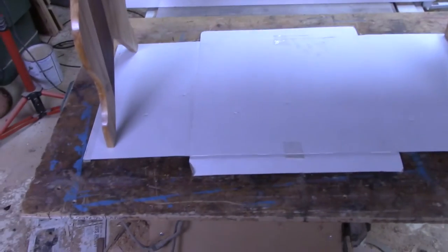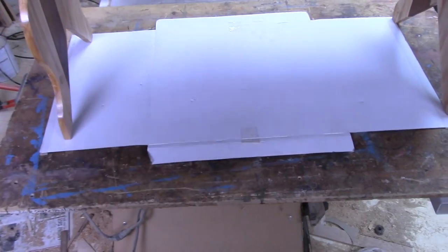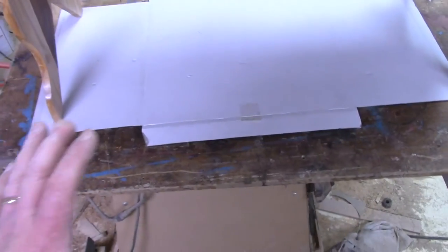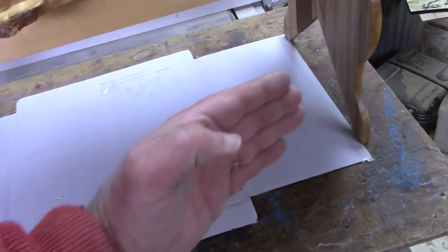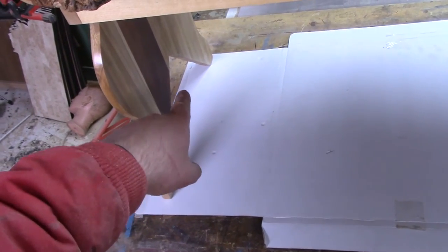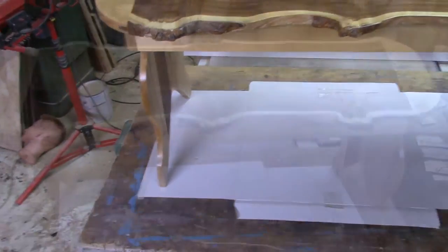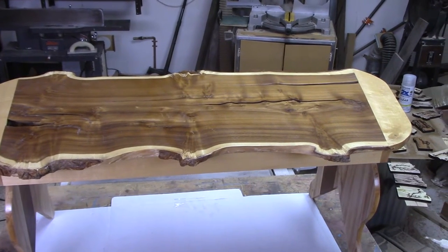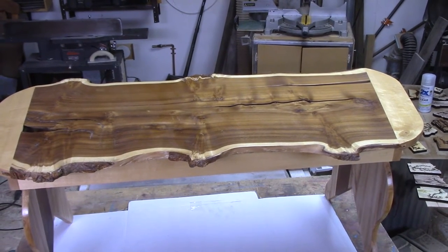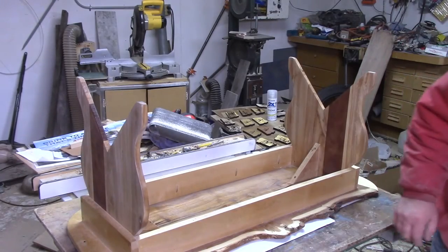It was just incredibly poor design choice on my part — I wanted these really thin legs, which I no longer actually find super attractive. I made one attempt to knock them loose but they're really glued in there, so we're gonna leave them. In addition to being quite thin, it's also got grain running the wrong direction. On that spalted leg back there, that's screw-up number three — it's popped, the same problem as the last table I built of the same vintage. Should be no problem to reinforce it and get it in that auction, even though the auction is next week.